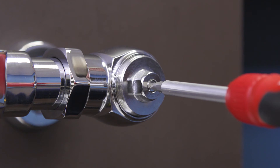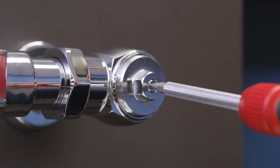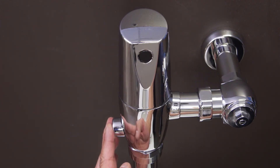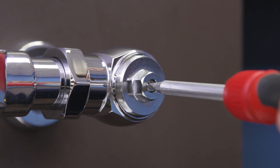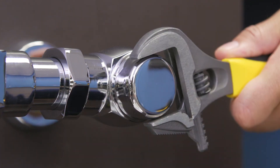Turn on the shutoff valve to the supply line. Next, use a flat blade screwdriver to open the control stop one full turn. Now test the flushometer — the first flush should eliminate all the air from the lines. If this is a new installation, it is recommended to flush the valve four or five times to clean out the supply line of any debris. Now adjust the control stop until you get a normal flush with a quiet operation. Finally, replace the cap.